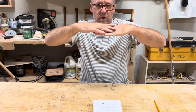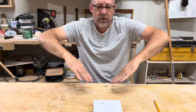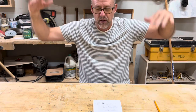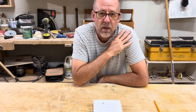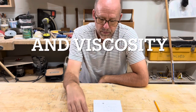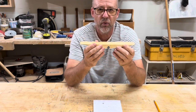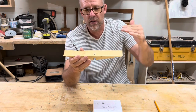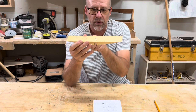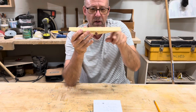When water is flat, there's no force on it. But if you depress water, the water surrounding it will go up and create a wave. The speed at which it goes up and down has to do with the density of the water and the force of gravity. That's basically what the Froude number studies — it studies the ratio between the speed at which water will go up and down and the speed at which the boat is traveling. There is a point where the water will be deflecting down and can never reattach to the other side.